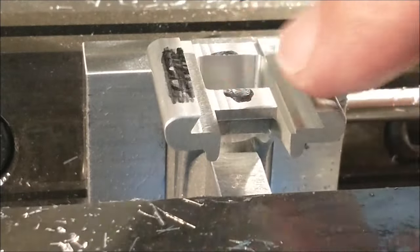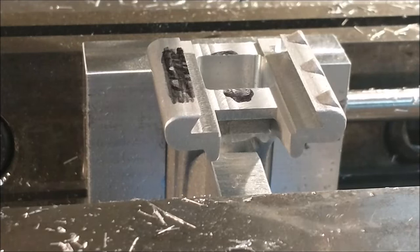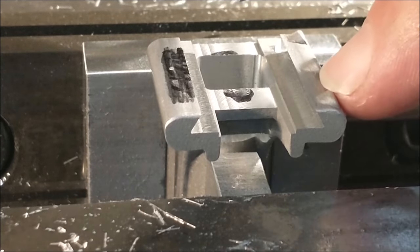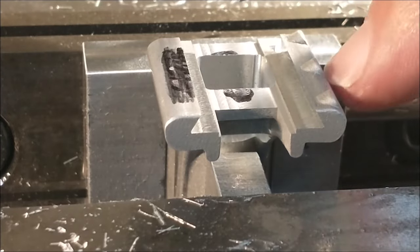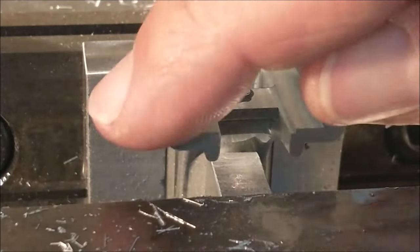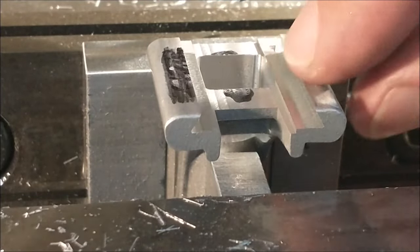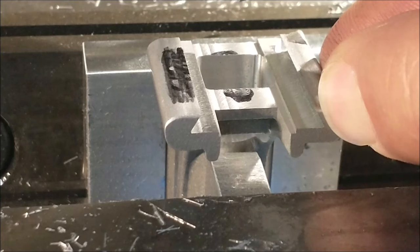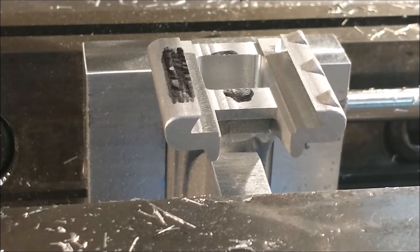This particular dovetail feature, it is up to the discretion of the person building this model whether or not they want a very smooth working fit or they want to go the extra mile and remove additional material from this side of that dovetail and use a brass gib driven by three adjustment screws as presented here on these cast features. So now that I know that the dovetail is adequate, I am going to take an additional about half a millimeter, 24 thousandths out of here to allow for that brass gib to be installed at a later date. Kills me to do this because I know this would be an awesome fit, but let's do it just by the numbers.